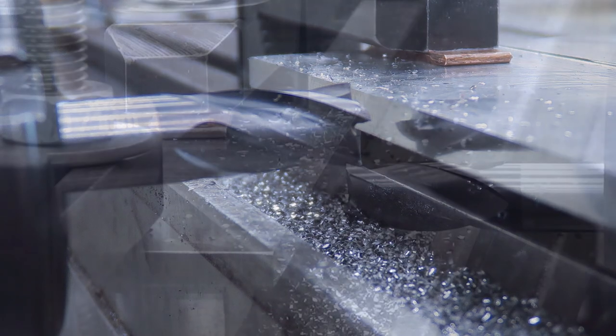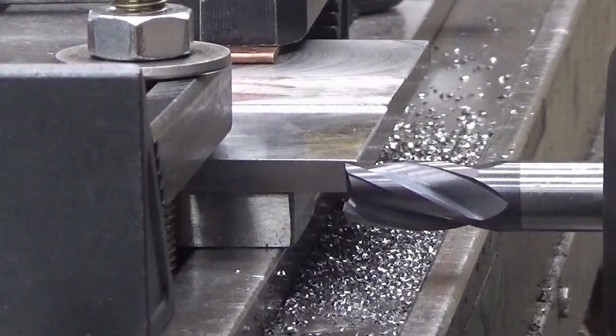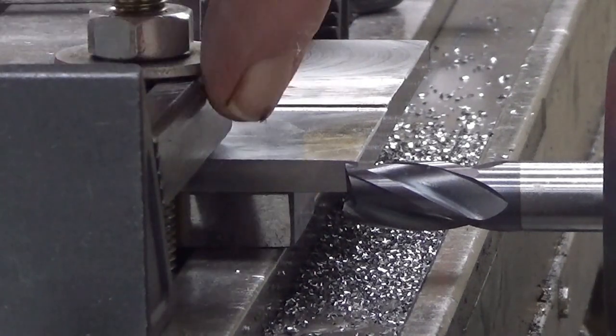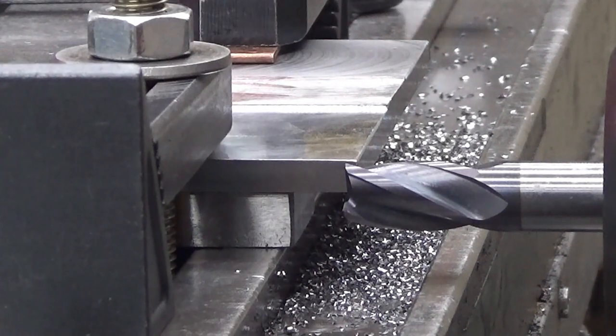And yeah, now I need to take it away from here and deburr it, and after that I turn it 90 degrees. Well, now this surface here is the one we just milled, and I have dialed it in so that in this direction it's absolutely straight. So when I mill this side now, it will become perpendicular to this side. Otherwise the parameters are exactly the same. So 400 revolutions per minute, half a millimeter cut, 30 millimeters per minute feed. And away we go.